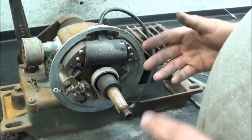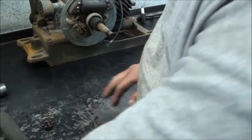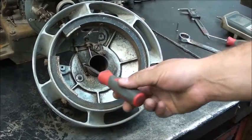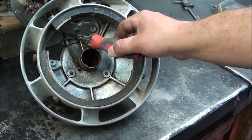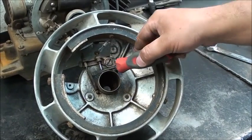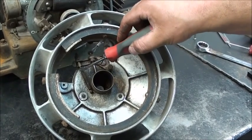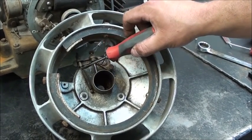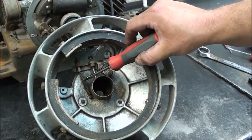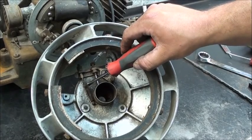The next step in timing the engine actually has nothing to do with the engine itself but with the flywheel. In here you have two screws. The screw on the left is spring-loaded, and there's a brass knurled nut up here that sets the speed. A good default setting is a decent amount of tension on the spring — that'll get your engine running and running fast. You can always loosen it up to slow the engine later, but it's better to start with enough tension so the engine will fire, then slowly loosen it to let the engine run slower.